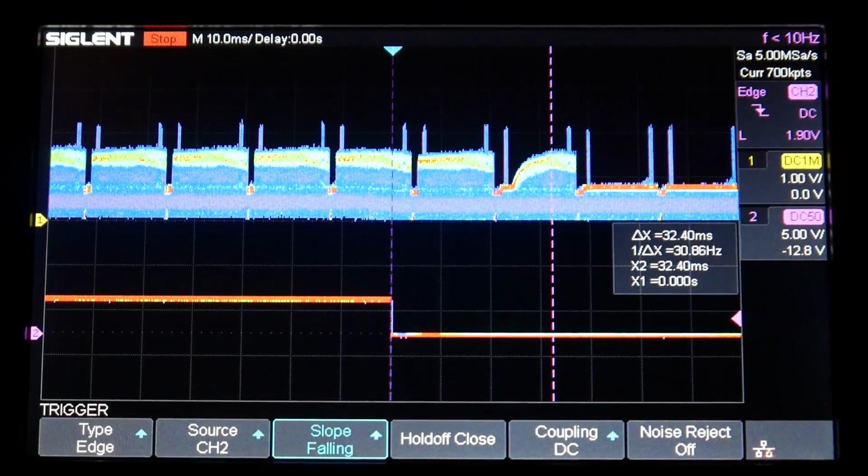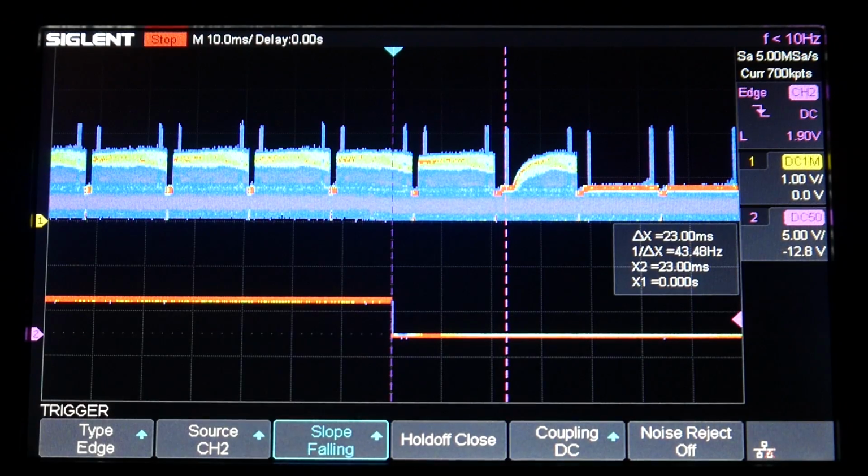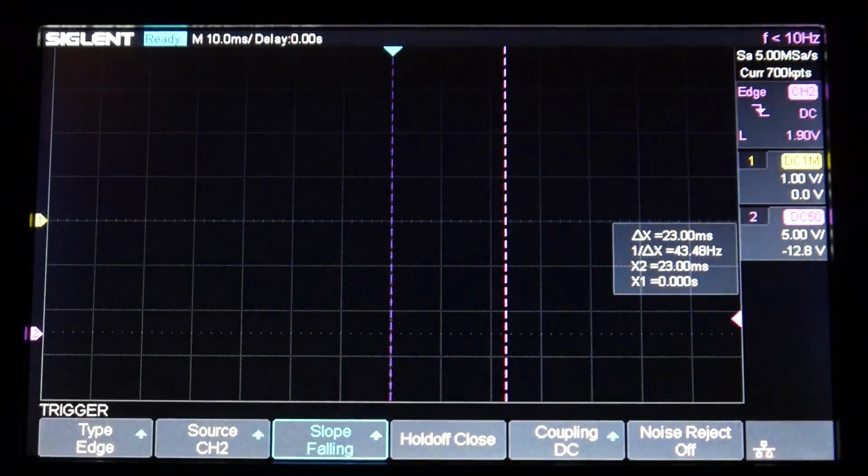I don't know what you want to say. We want to say it picked it up right here, or it picked it up all the way over here. When the LED turned off, it was around 37 milliseconds, as you can tell right there. And if you wanted to count it from here, it's up to you. It's around 23 milliseconds, but we're going to take more samples here.